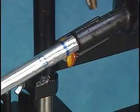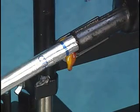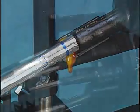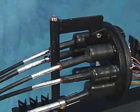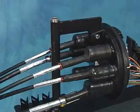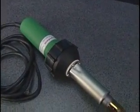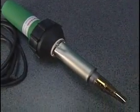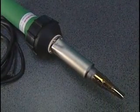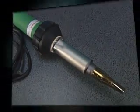You should then see a little melted adhesive coming from the cable end of the seal, and the seal should be completely black. Repeat this process until all cables are sealed in the base of the FOSC400 closure. Tyco Electronics supplies a hot air gun that is designed for getting the required amount of heat into the seals of the FOSC400 and related heat shrink closures. Contact your salesperson for additional information.